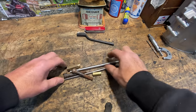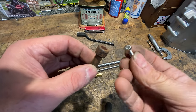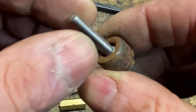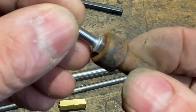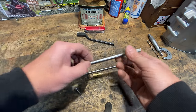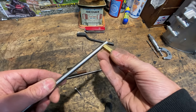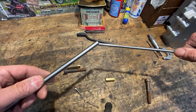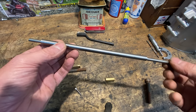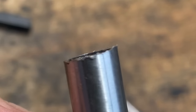Back in the garage with all the bits on the bench, I look at the M10 cap head bolt. This is ideal because the hexagon inside is 8mm, so it fits an 8mm nut. The piece of tube will become the outer body, and one of the pieces of brass will be the little lever. The lever could be made from steel, but I like working with brass. The outer tube is already around 10 inches long, so that's just perfect.